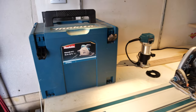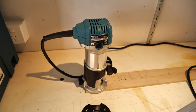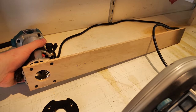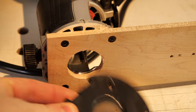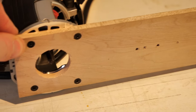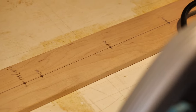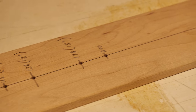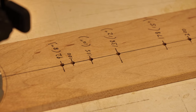Here are the major tools. I've got the Makita track saw, which makes cutting panels and baffles easier. I've got my little trimmer with the base removed and I've made a little radius jig — a quarter inch single flute cutter in there, using the base as a template to reuse the same screw holes. This jig is made from a fretboard blank and some low-grade maple. I've got holes set for different radii, including longer ones for furniture joinery.